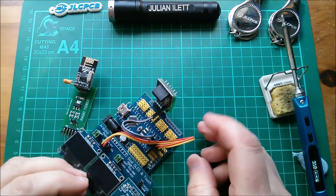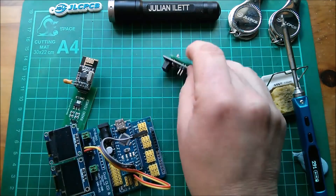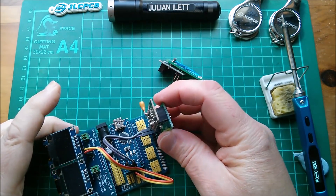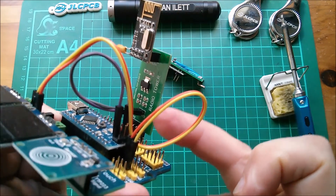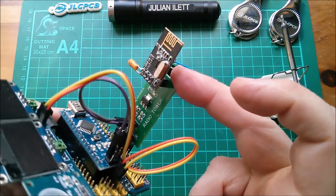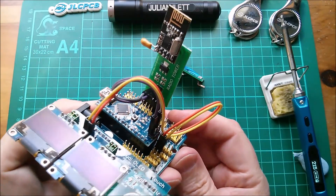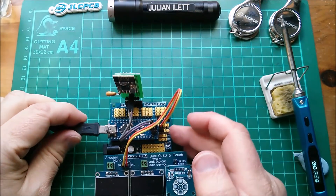I've got to remember I'm working from D13 to D9, so I'm going to be biased that way with my five-pin connector. VCC and ground - I've marked on there, so it says ground, VCC. That means gray is ground, purple is VCC. That plugs in there and that is my new radio tower - with built-in 3.3 volt regulator to drive the NRF24L01+ wireless board. It's powered by 3.3 volts but has five-volt tolerant signal lines, so all the signals coming in off the Arduino are five volts in swing, but the unit itself runs on 3.3. Should we plug it in? No rehearsal - let's do it live and see if it works.